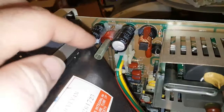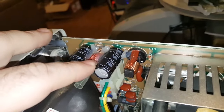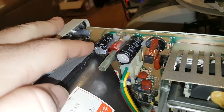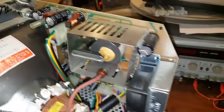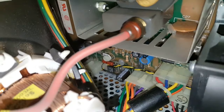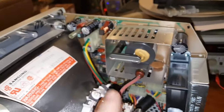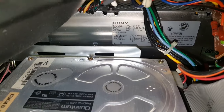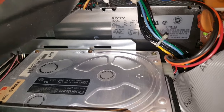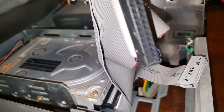There's a capacitor here that couples the horizontal yoke winding to the horizontal circuit. Back in those days electrolytic was apparently the only thing available, but any competent engineer today would use a film cap in that circuit — I don't know why they didn't. I have all the parts on hand to recap this thing, so we're going to do a full recap of the analog board and the power supply. That's a Sony CR-44 power supply; the schematics are available online. It looks like it was made in the ninth week of 1989 — a fairly early production run.